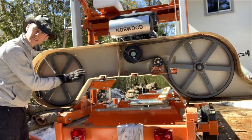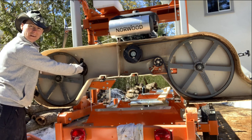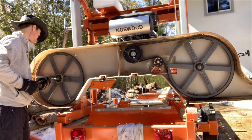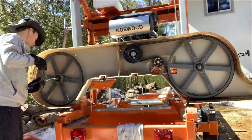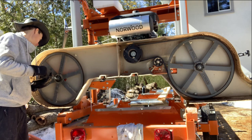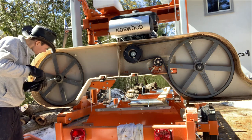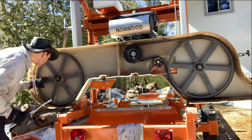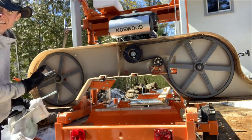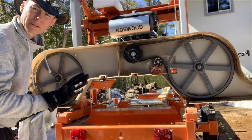There's going to be a little more play on here because there's no tension on this axle, so this is absolutely normal. You should be able to get your hands in behind all the way around. Okay. Perfect. Because that's the idle wheel, I can just spin it and pump at the same time. It's nice, you know, then that whole bearing is packed.